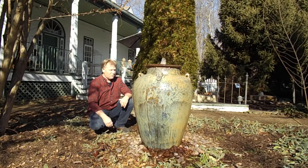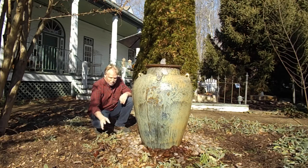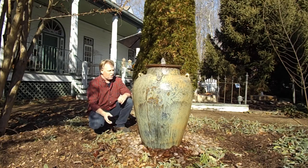In that 15 years, those two hours worth of maintenance is cleaning the intake on the pump. That debris will finally work its way through the screen. I basically pull the rocks away, lift out the panel for pump access, grab the debris and throw it out. You have to do that about once a year. The first time we installed it, we only had to do it after about the third or fourth year. But now it's a yearly thing — enough debris gets there that we have to clean the pump. It takes about two or three minutes.